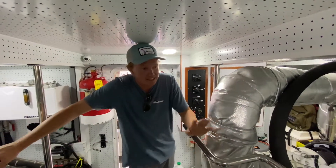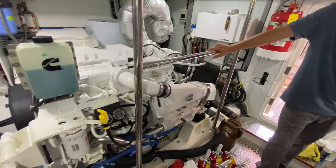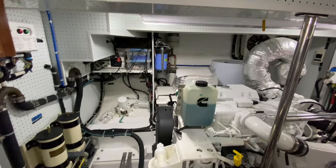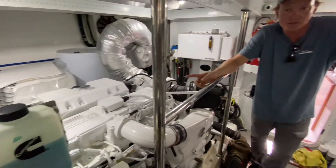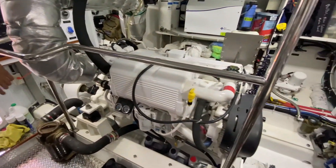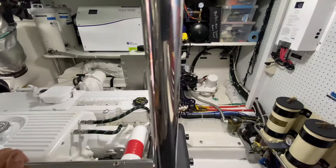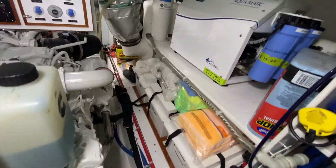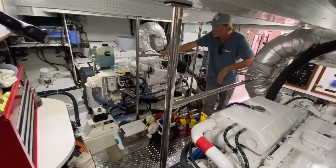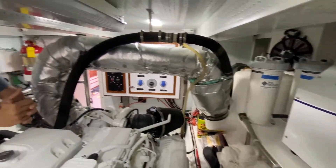These ones have the Cummins 600s in them. The last Nomad we built had the 600 Cummins, the one before it had the 800 horsepower MANs, and we've also put Caterpillars in them. With the giant engine room you have, you can pick pretty much whatever motors you want because they'll fit. These 8.3-liter 600s are fairly small engines for this engine room — you can see how much space you get. They're a perfect engine for this boat — nothing underpowered — but they're just really small in here, so you have a ton of space to get to everything outboard of the engines.